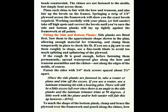When you've checked to see that they're parallel, level and ends lined up exactly, drive a 3-inch deck screw, toenail fashion, into each end to hold them down securely. Then measure off locations for the two molds and fasten cleats to the outer sides of the stringers at these marks. Screw the molds to these cleats with deck screws.